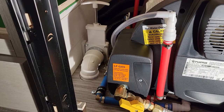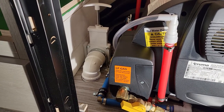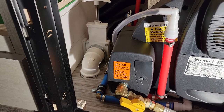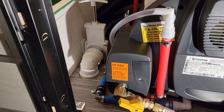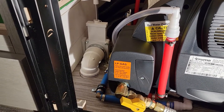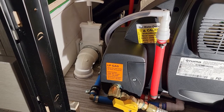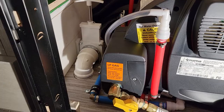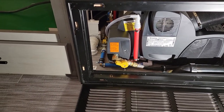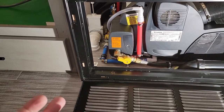It's not completely sealed up under there either — there are several spots where air gets in. So I tore out the whole underside and put in two-inch thick foam board from the tile industry — Schluter KERDI board — in panels 24 inches wide by 10 feet long. I ran them across and ripped some plywood for the seams so I can take any panel off to access the underside anytime. It's really well insulated down there now.